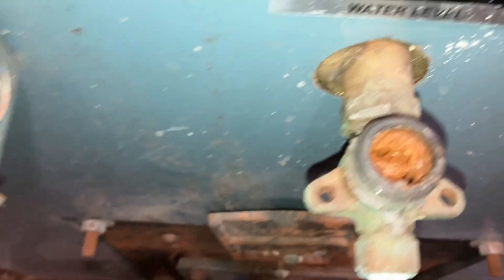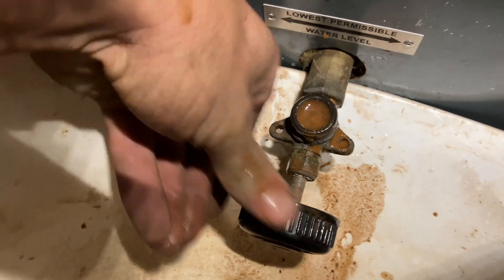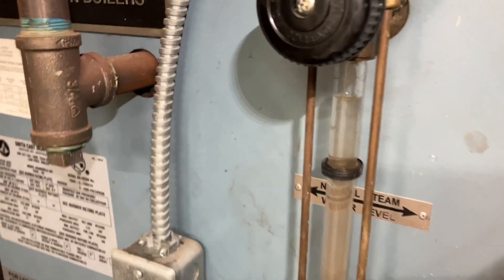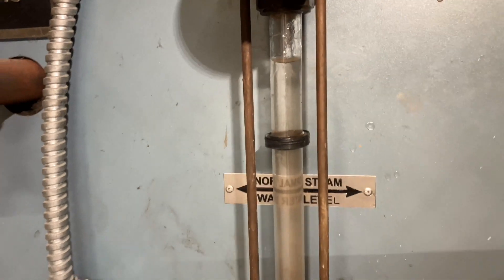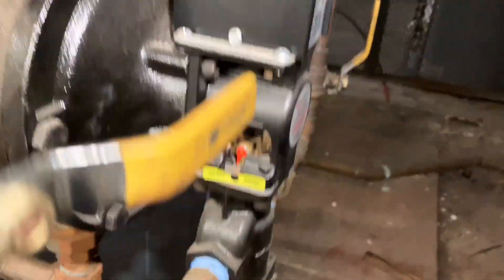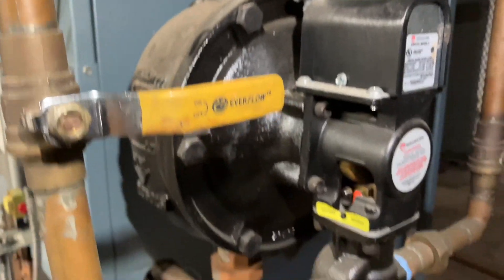Before I go — a lot of mud in there. I'm gonna open up the sight glass and just wash out all that mud. New gaskets. Water level is pretty good, creeping up a little bit. What I don't understand though is why our water level is above normal. It's still filling — I think our head assembly is plugged up. Time to drain it and find out.